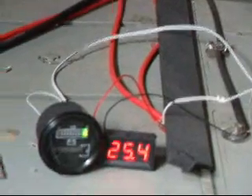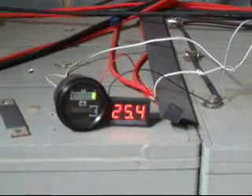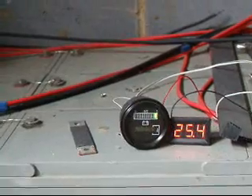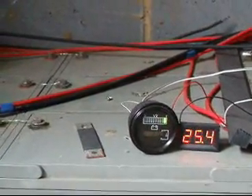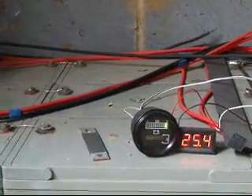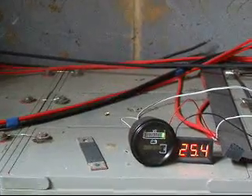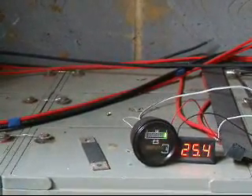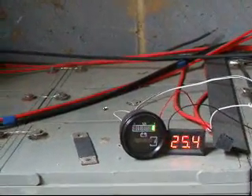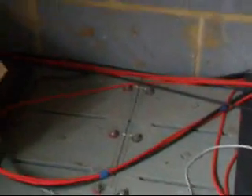On battery monitoring voltage, the digital meters in red are very, very good — I bought those from China. The round battery monitors are not properly made. They might possibly work with car batteries which might be working at a lower voltage than valve-regulated lead-acid batteries.